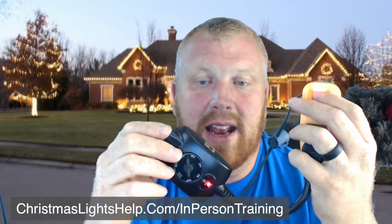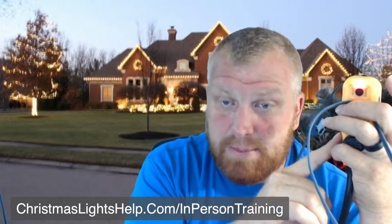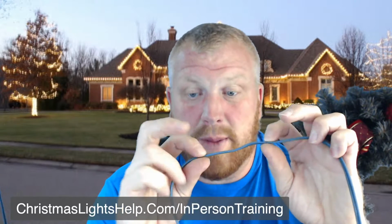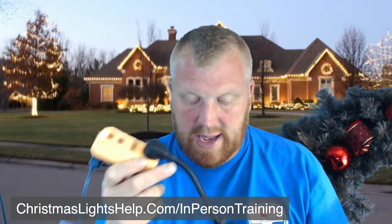So that's the same thing, that if I cut this cord and it's plugged into hot power, it should, it don't always, but it should pop this. And when it pops it, then that way we know what issues we had. And there's lots of things can pop this. One time I had a whole nice roll of wire. It was a 500-foot roll of wire, and about 300 feet into the wire they had spliced the two wires together with no coating on it. So it was about from here to here, and it was complete bare wire where they just wired that sucker up. And so that would have popped it, because it's just a straight right across it there. So that is definitely something that we need to do.